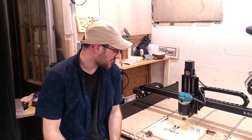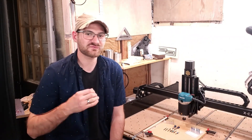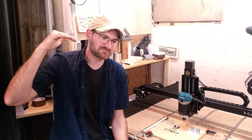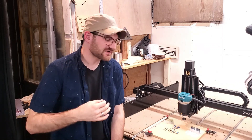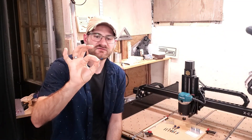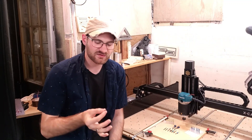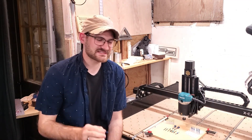What I have here are some of the bits I use personally. Most of them are end mill bits - flat end mill bits - instead of the curved or round nose, because most of what I do is cutting material. I'm plunging my bit into the stock material and then it's moving along and removing that stock material for my designs. Now if I'm doing engraving, what I actually use are these V-bits. I have a couple over here as well. The V-bits are what I use for engraving, for doing letters, and also for some detail work.